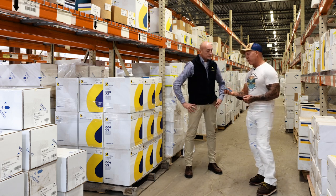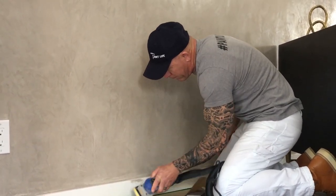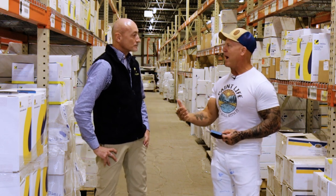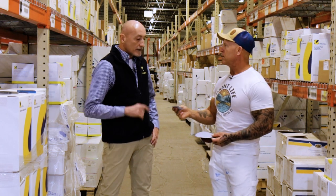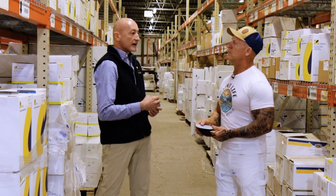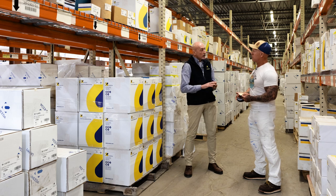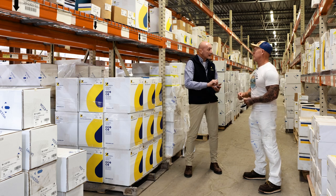When I first started with abrasives I heard the term 'loading' and had no idea what it was. Heat is an important factor in successful sanding — keeping the heat down and not loading your abrasive. Loading is simply just what it sounds like. It's when the fibers, or if you're sanding a finish, end up getting caught in between the grains. The finer you go, the closer you bring those grains together for a better finish. But if they load up, it's going to quit cutting because the loading material is now higher than the grains and you're not getting that cut.